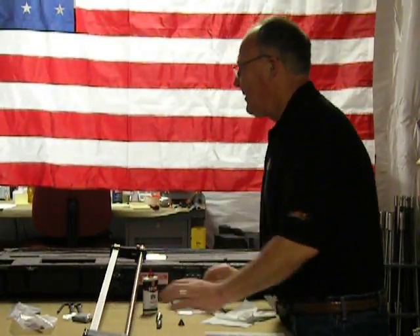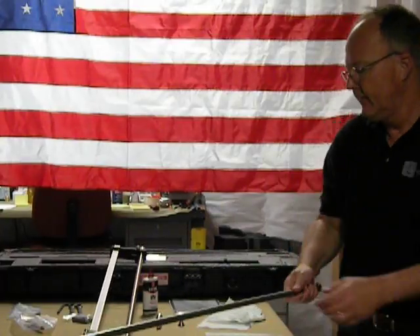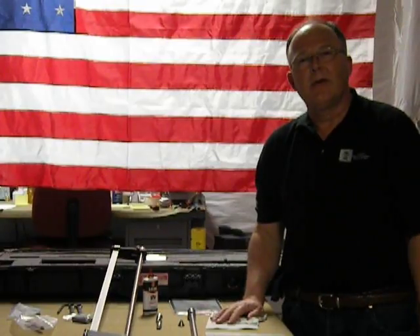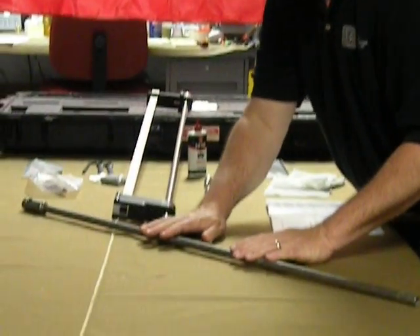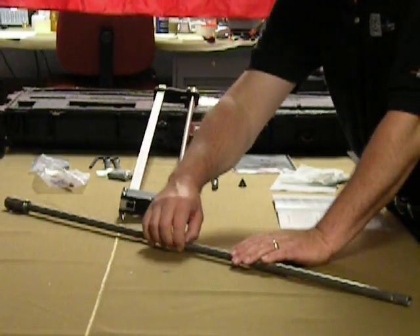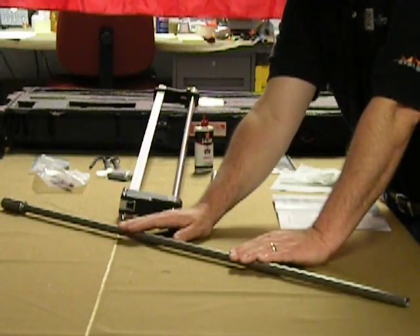The other method is by rolling the drive rod. Take a drive rod outside of the vertical scale and on a flat surface, roll it. You want to see if it rolls nice and straight — the gap between the flat surface and the drive rod should stay the same, indicating that it is a straight drive rod.